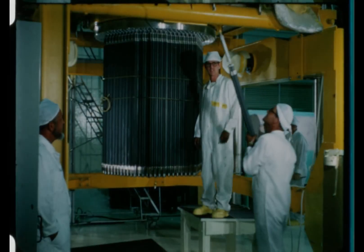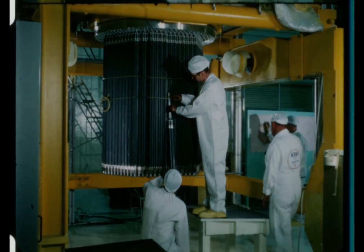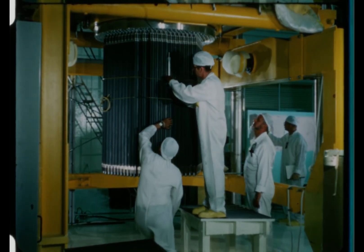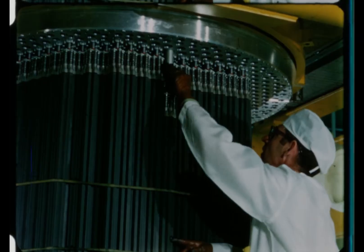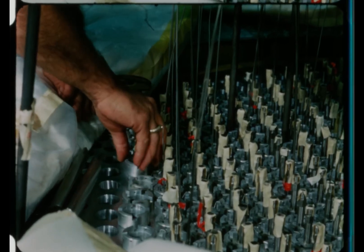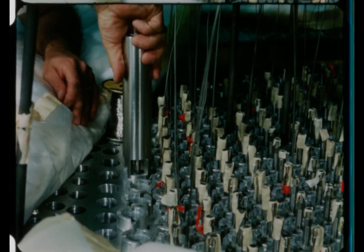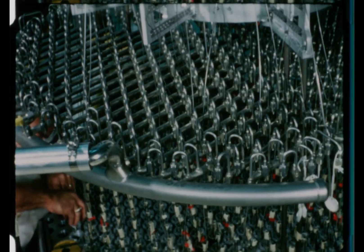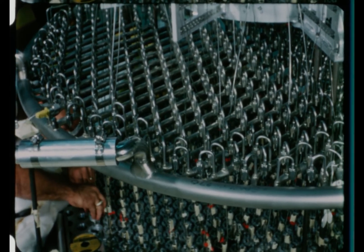Unlike its predecessors, 2A was assembled in an inverted or cold end-up position. This method of assembly was chosen to eliminate the possibility of any shifting or twisting of the clusters during assembly. Tie tubes were used instead of tie rods to support the clusters of fuel elements. Tie tubes were cooled by a separate flow of liquid hydrogen, which rejoined the main hydrogen flow at the core inlet plenum. This regenerative flow system marked a major performance improvement because it avoided discharging low-temperature hydrogen into the nozzle chamber, allowing higher exit gas temperatures and an increase in specific impulse.